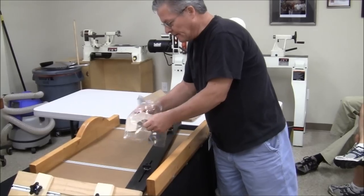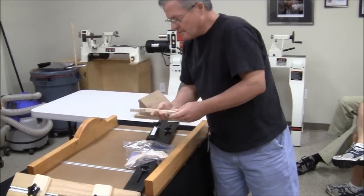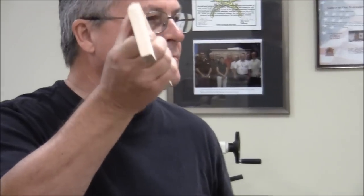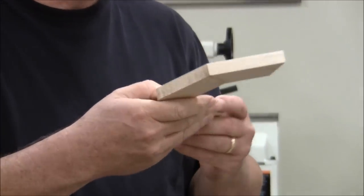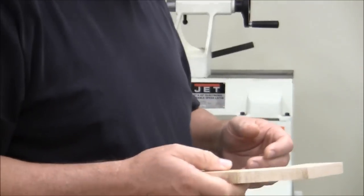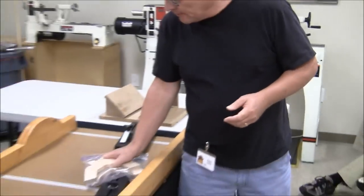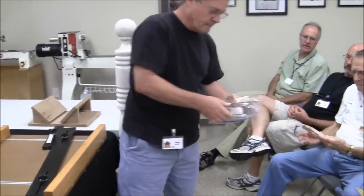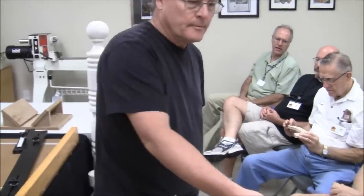In segmented turning, one of the main objectives is to cut these little pie-shaped pieces of wood and then glue them together and make consecutive rings that are a little bit larger in diameter. And you can construct your bowl out of that. I'll pass this around for folks who may have never seen them. But,